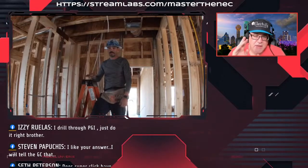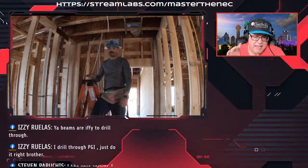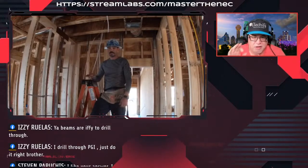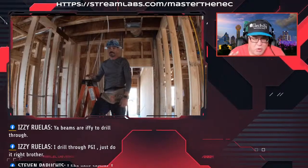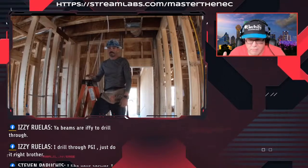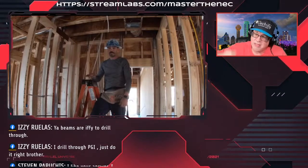But I'm going to tell you, if it comes to an engineered beam or a laminated beam, do your best to go around it. And if you have to drill through it, seek the building engineer or the general contractor. I'm just telling you from my experience, but that's not what we're talking about here. You can drill through these, okay? And a lot of times, how in the world would a duct guy get through these? They end up drilling a series of holes so they can knock it out and pull their ducting through it. So trust me, from an electrician standpoint, a three-quarter or 1 inch bore through there is not going to cause a problem. But at the end of the day, if you've got the prefabbed holes, just knock them out.